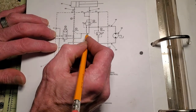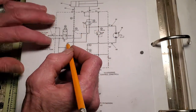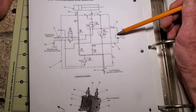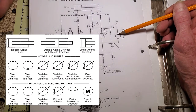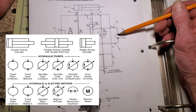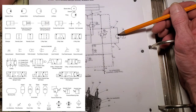All these solid lines are primary lines, and these dotted lines are pilot lines. I linked a playlist I watched to understand what these symbols mean. These triangles facing inward mean it's a motor; if they're facing outward, it's a pump. Two triangles means it's bidirectional. So the board brush motor has two inward-facing triangles, indicating a bidirectional hydraulic motor. Filled-in triangles mean it's a hydraulic or fluid system; empty triangles mean it's an air system. This right here is the board brush arm that extends out.